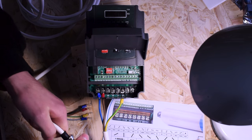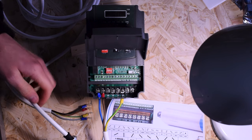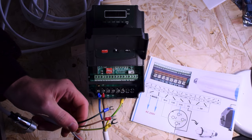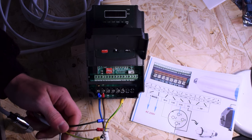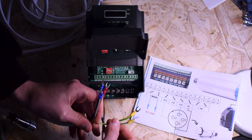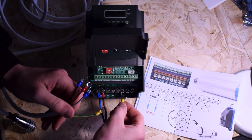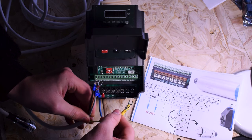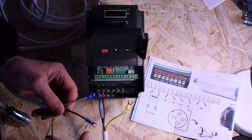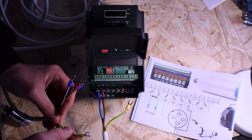You also want to make sure you clamp down the cable grip here — tighten it so it really grips the cable. If the connection is yanked, it doesn't rip off the solder joints, which could cause a short. At the other end, note which color wire was which pin. I keep the earth as yellow-green. In my case: gray is pin 1, black is pin 2, brown is pin 3, and pin 4 is earth going to FG.